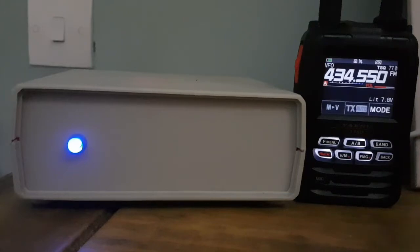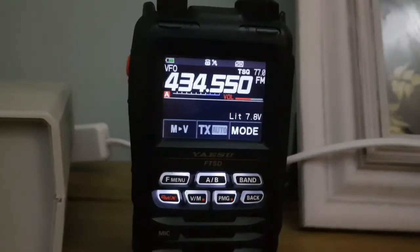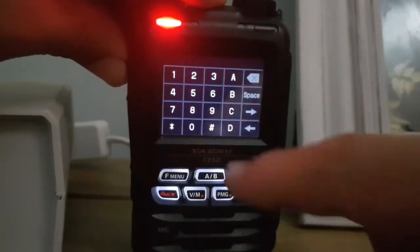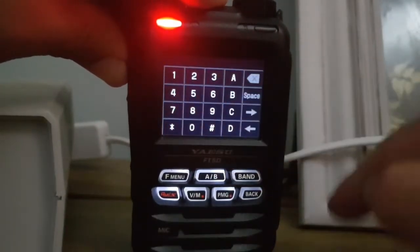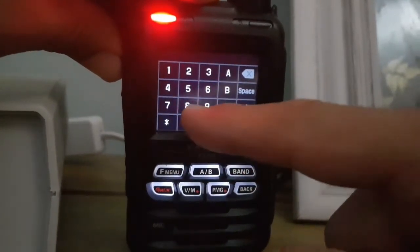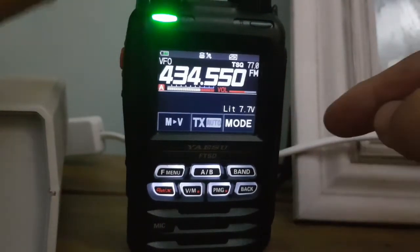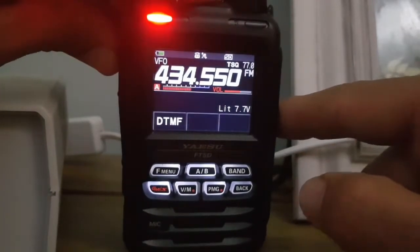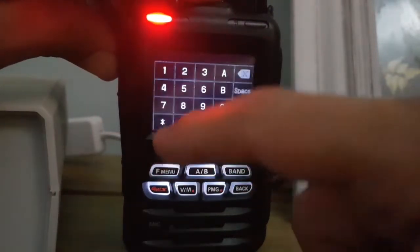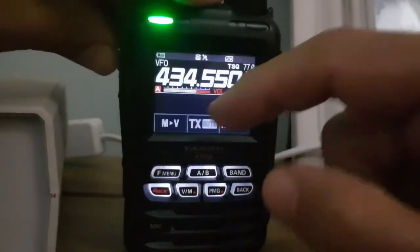We know that's working. Now, if we want to use the radio to DTMF into it, on the FT5 you've got two options. When you press PTT you get the option to go DTMF and type it in — star 34152 2 is what I use, or star 408 94 for an audio check. I've pre-stored it in memory, so we go DTMF and number one — that's a pre-store. We're now connected. If it doesn't work first time, just do it again.